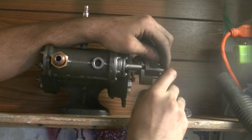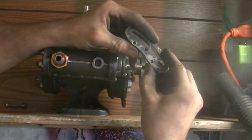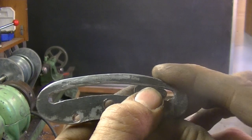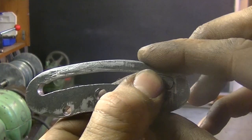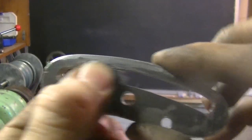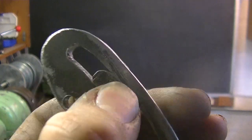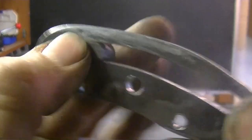I'll probably do some profiling and add a little more metal under these holes, but I'll do that off camera. I didn't show it because it was pretty much the same process as the expansion link, but I made the die block — I just filed this from a piece of steel. You can see how it moves smoothly in there with very little to no play. You'll see it work in action towards the end. So that's it for this video guys, thanks for watching.